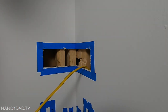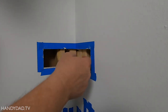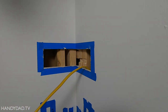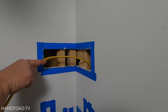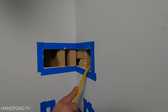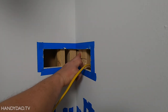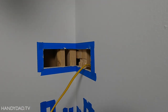There are two ways to run the wire. One is to drill through the studs as close to the middle as possible — but I would have had to cut out a lot more sheetrock and try to turn the corner inside this little cavity. The other alternative — which is a lot easier if you have a sharp chisel — is to notch out the stud below the sheetrock, and then turn the corner on the surface. I have four studs to notch out. The only thing is, that leaves the wire exposed very close to the surface and somebody could put a nail through it. So we want to get a nail plate to put across and protect those wires.